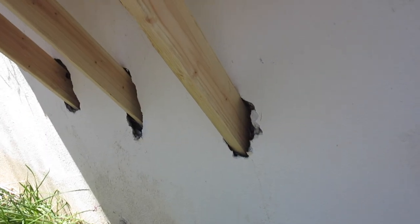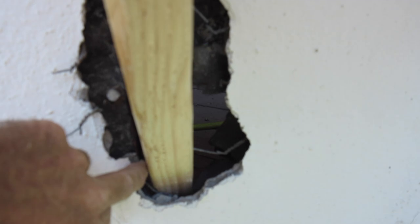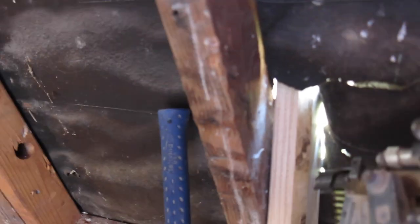Get that brace in there. I've got a border piece here and I'm going to tag it to a stud. Meanwhile, I've got to make it level — this board is all floppy. So get out here and put a kicker. You've got your board coming through this side and you just nail it to the stud.